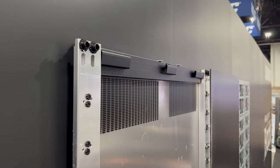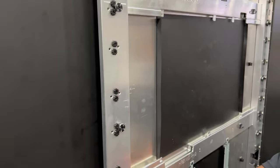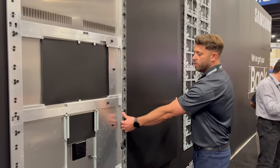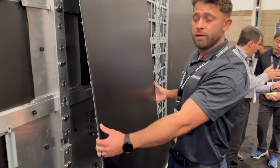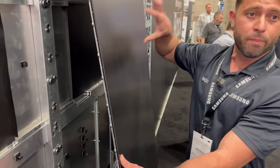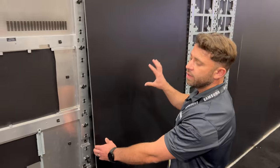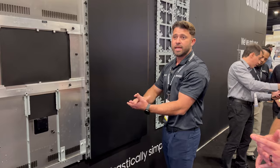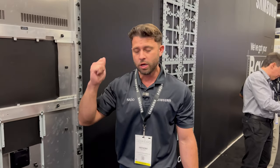With the 146 model you'll have a left and right half — two pieces that will be joined at the center seam. Included in your kit will be a top and bottom bracket that joins them. The modules themselves come in four pieces and drop into your frame kit. All modules are pre-installed and pre-mapped, labeled in the box — left one, left two, right one, right two. You drop those in, everything's pre-mapped, plug and play, ready to go.